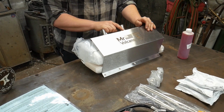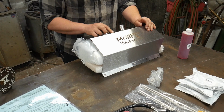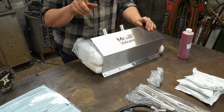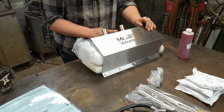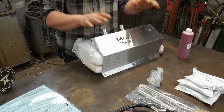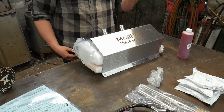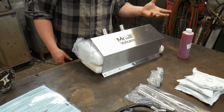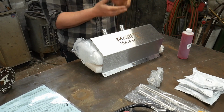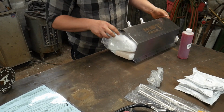But it says, you must remove the unused burner if operating the forge with one burner. Failure to do so will, underlined, result in heat making its way up the unused burner and melting the hose connection. So they had to put that big disclaimer on there because people were trying to shut off one burner and just run off of one singular burner, and it chimneyed up the unused burner. That's basically what it is. It's a chimneying effect.